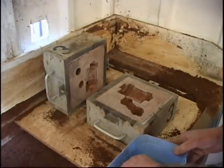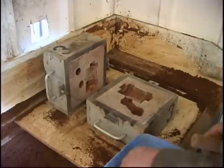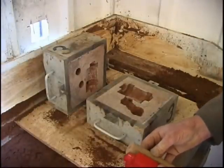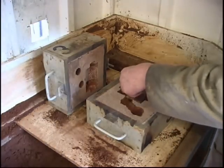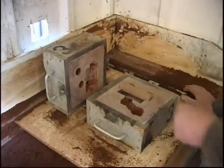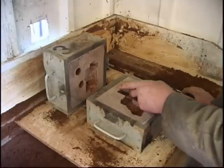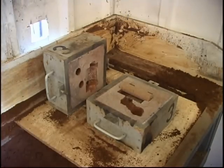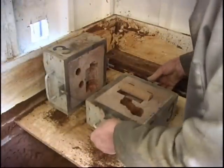Need a core — I've got a couple left. Select the best one. Check it for length. They've got what they call core prints. Gently place that in there. The metal runs down the sprue, into the basin, runs along the passage, through the gate, fills it up, and you're left with a hollow where the core is. We'll put this somewhere safe.